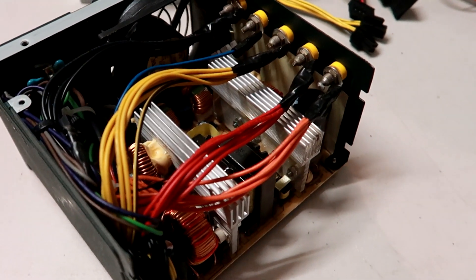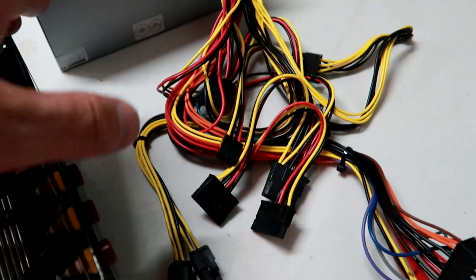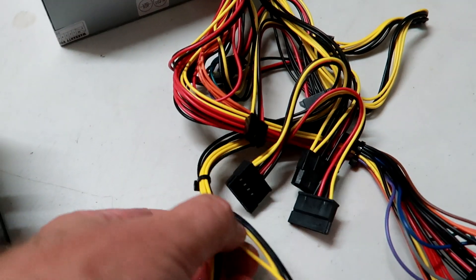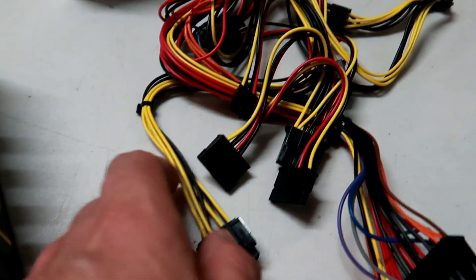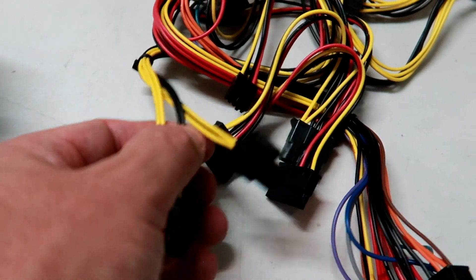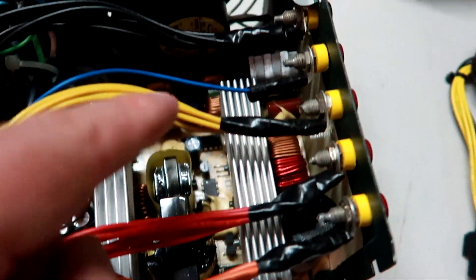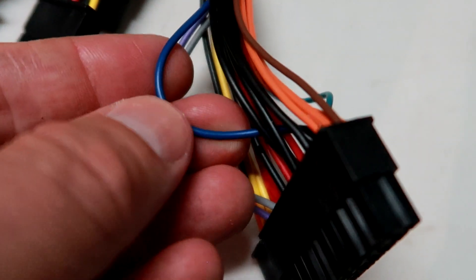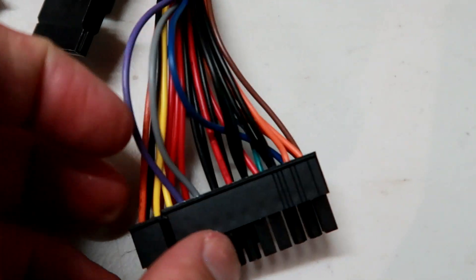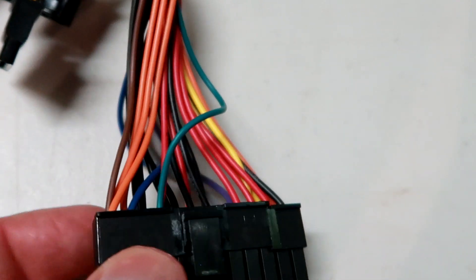Alright, so this is the inside of my power supply. With a new power supply it's very easy to start — you just need to collect and connect all different colors together: all the yellow ones, all the black ones, the red ones, and the orange ones. These are all the colors you need. Everything else, don't worry about it. You probably want the single blue cable as well for the minus 12 volt. And then there is a purple and gray one which I'll talk about in a second.